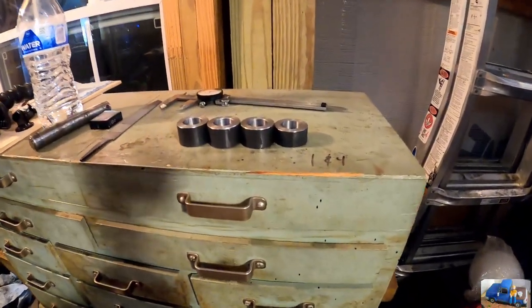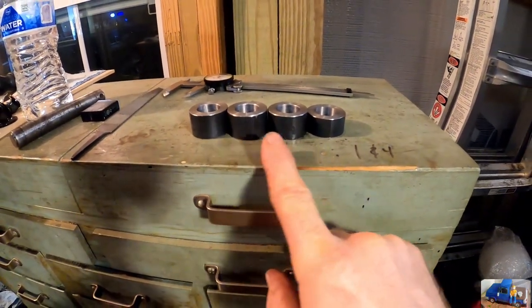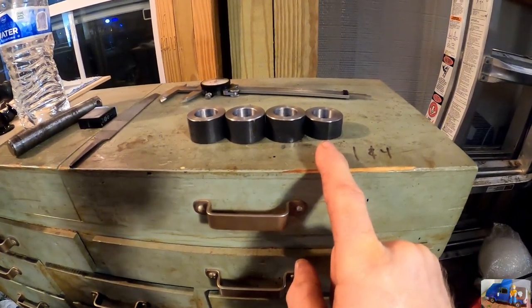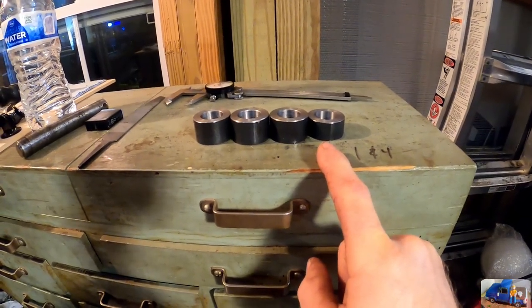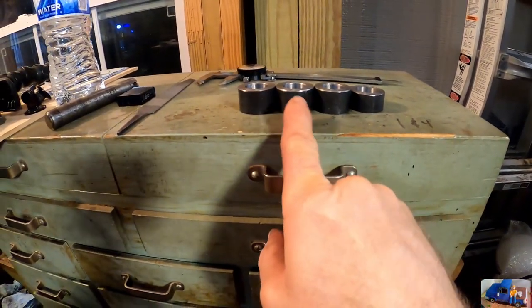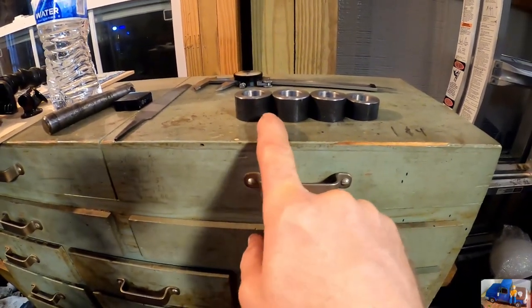Zoom in for effect. End product. So I need four basically bore slash bearing extenders, and I wanted to complete this relatively quick process, not necessarily precision. So I foobarred a little bit, and specifically this one here. These are within 10 thou, they're about 8 to 10 thou over 3/4.